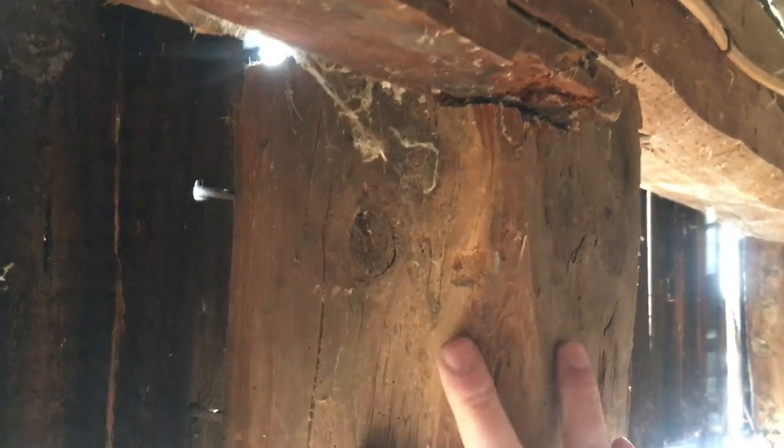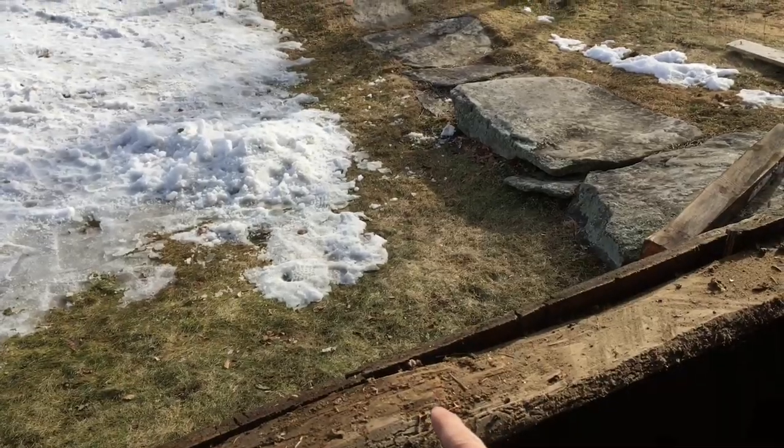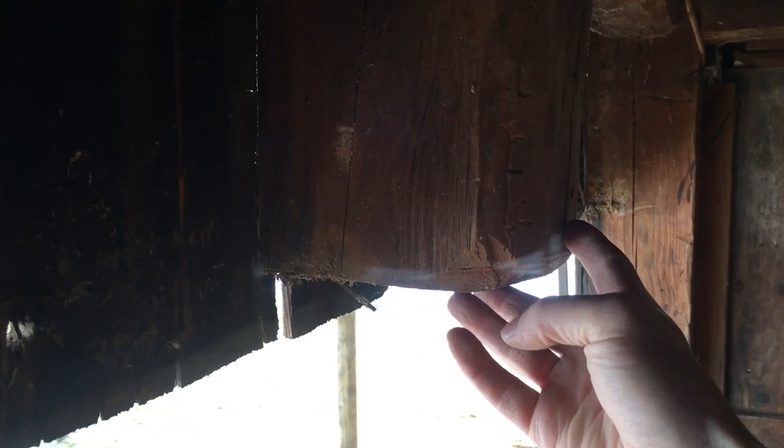So this is tricky and I actually need to now support this from here down to this girt. I'm going to get a piece of six by six and cut it to length rather than rip this chunk out and then have to notch the mortise. I think I'm just going to leave this here, cut the new piece and then toe screw it with the GRK structural screws, the five and a quarter or five and an eighth inch long. That should be sufficient because the load is just vertical — and it's only really loaded when this door is open. So let's get on that.